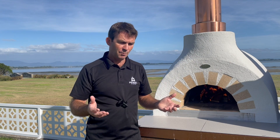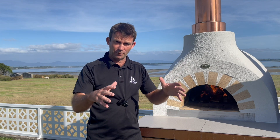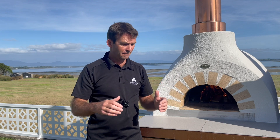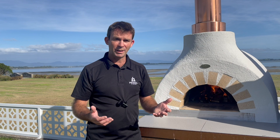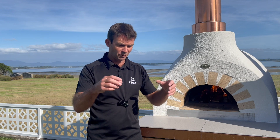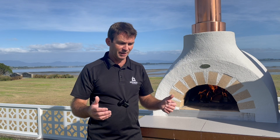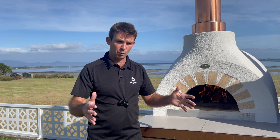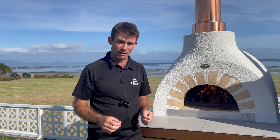What they do is pour the very top of the dome in a castable material. So it's very well proven, and what we're doing is using a cardboard mould to cast this refractory material over to build a fantastic pizza oven. Instead of spending three or four weekends building a brick dome with intricate little pieces, you're smashing it out in a few hours. The outside of the ovens looks very similar, but the inside is what's called a monolithic pour — a one-piece pour over that cardboard mould.